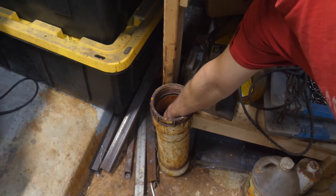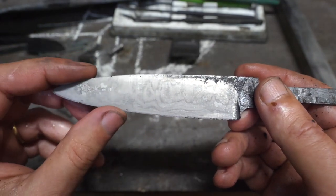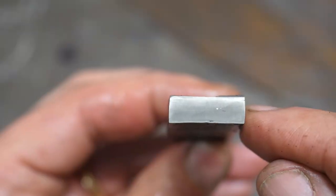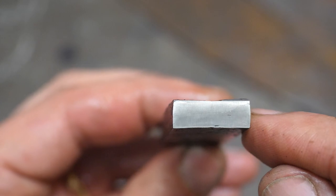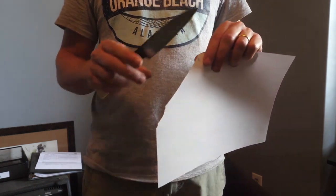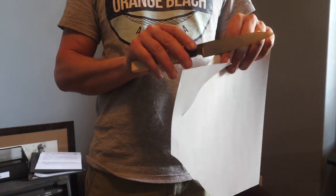Now it's time to etch it, because this is not what I expected at all. And bam — here it is. We have at least two steels here. One hardens to around 65 HRC, maybe a little better. The other, just over 55 HRC. This was not evident on the etching of our billets earlier — because they weren't hardened when that etching took place, and that decreases the contrast offered by different steels. All those different striations of harder and not-as-hard steel account for why I described the edge as toothy when I was doing the cut test — that would be a good explanation for the toothiness.